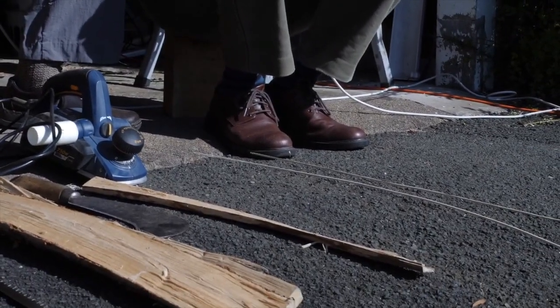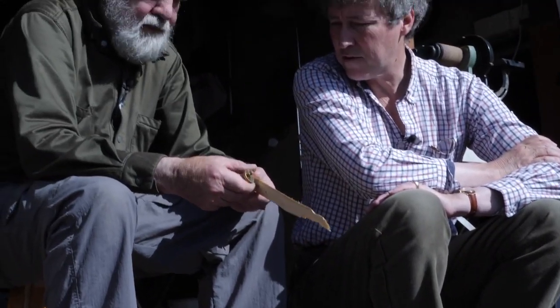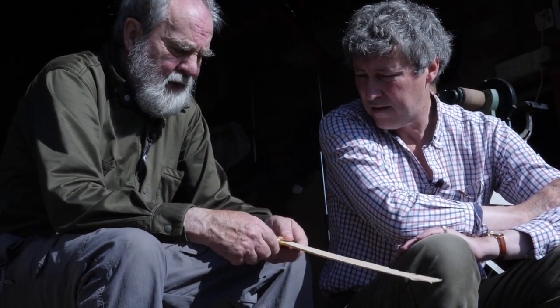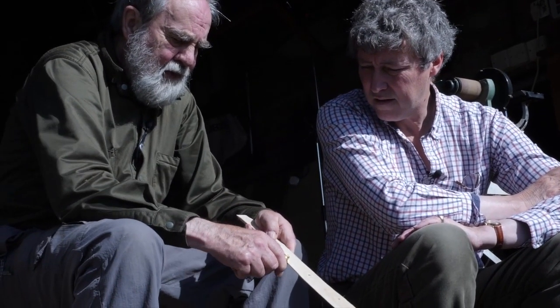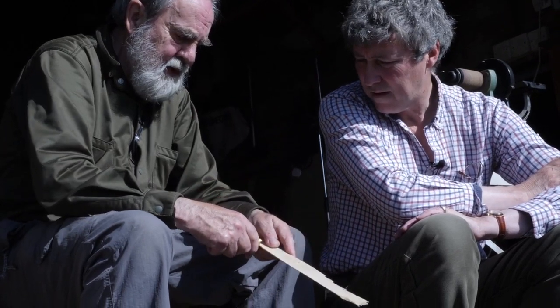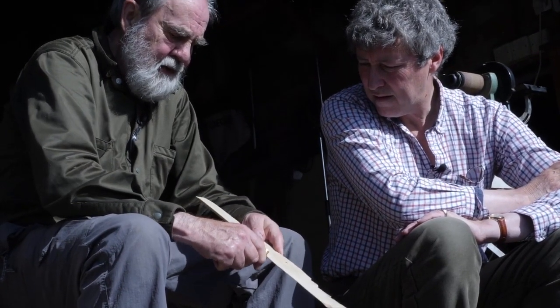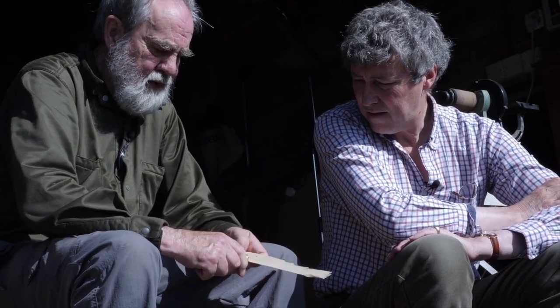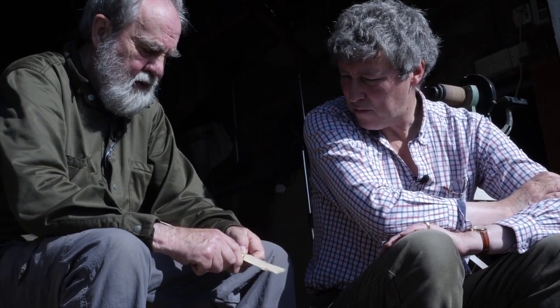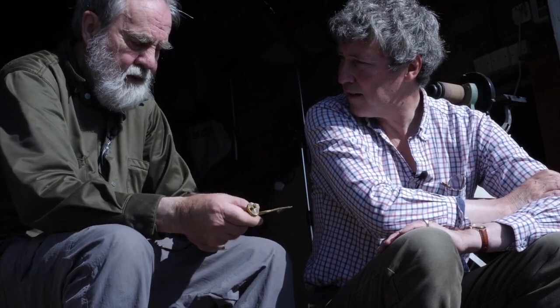And what thickness are you putting on that? Is it again about 2 millimetres? Yes, this is too thick really. Well, I could cut a strip off here, say, and put it on the sander. It takes several cuts usually because it doesn't go very far. But anyhow, that gauge is set for 2 millimetres, and you're aiming to get the wood roughly 2 millimetres square.